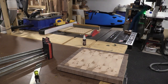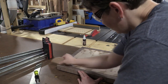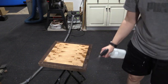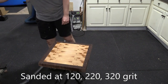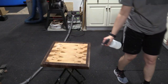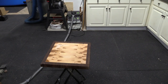End grain takes a tremendous amount of sanding if you really want to get those lines out, especially from the drum sander, and this hard maple took a tremendous amount of time. One tip: I used a socket of the same size as my juice groove to really get in and sand those. Another key step is to raise the grain — spray your board with water and let it dry. I did this between each grit, and each time it caused the surface to feel very rough again. Once you spray and it dries it feels like you never sanded it, but your client won't have that rough experience when they first wash the board.